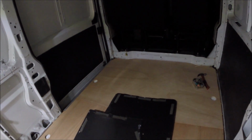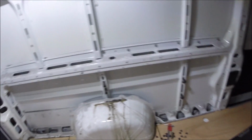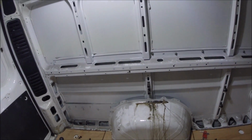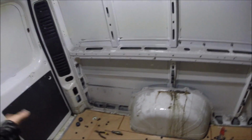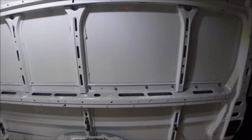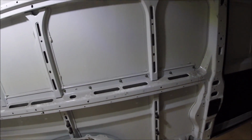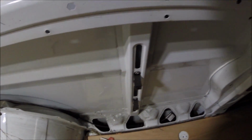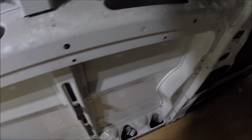I did crack one of the boards because I was just going a bit gung-ho to start with before I figured the method. But yeah, literally push the board to create a bit of a gap, put the screwdriver in, leave it a little bit to put the long nose pliers in, and then just work them up towards the edge of the board. That way at least you don't see too much of the marking on the board. But yeah, I didn't realise this. Hoping it comes out okay, but that's really quite deep.